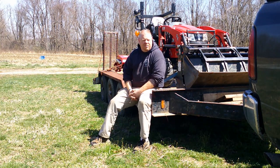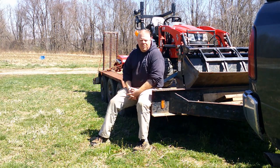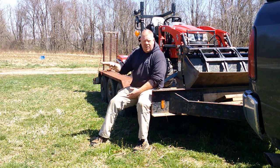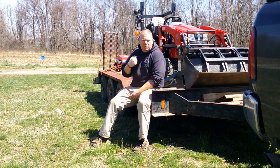There is some weight back there for sure. I want to say it's right around 600 pounds for the tiller. So that's good, because when I was unloading the tiller, we had the heavy hitch on, which is only 100 pounds. And I can tell you right now, when I chained the tiller to lift it off the truck, it wanted to raise the rear end of the tractor up, clear up off the ground, because there's no weight really on the back of these 24s.